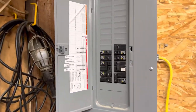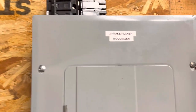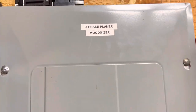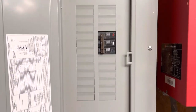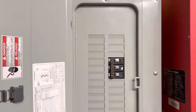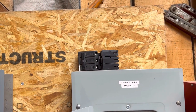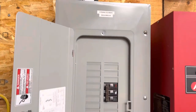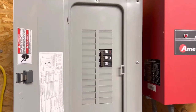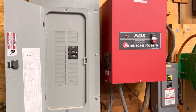That's all I've got running right now. What I've done from this panel is subbed out a three-phase panel, which is over here — you'll see I've got it labeled up. Currently I only have one breaker in here, the 60-amp breaker for my Wood-Mizer. I bought on eBay a couple extra 20-amp breakers to set up so I could have a couple different circuits. I won't necessarily run all the circuits at the same time, but it's nice to have the connections in place.